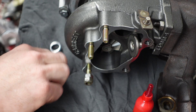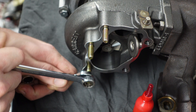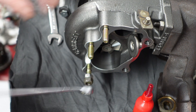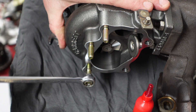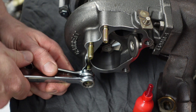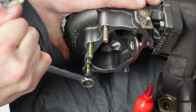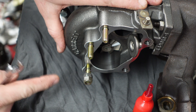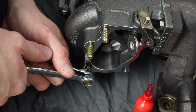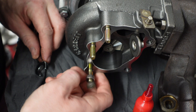Here we go, I'll show you what I mean. Just tightening those two nuts together — tighten them together — and then on the outside with the last nut, you can now tighten the stud all the way in until you feel it's tight enough. It is a tapered fit so it'll only go so far. Now that's well tight — I'm happy with that. And then it's just the reverse to remove the nuts. That's how you install a stud when you don't have the right tool.